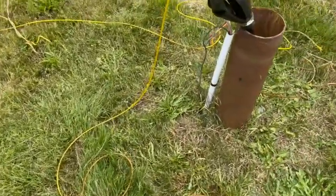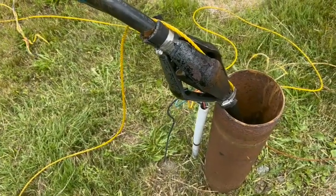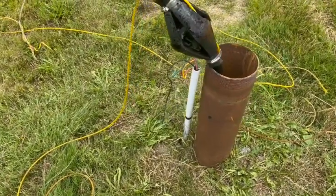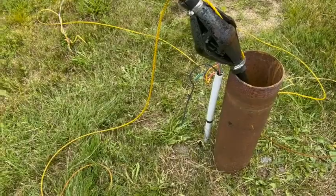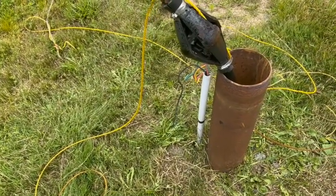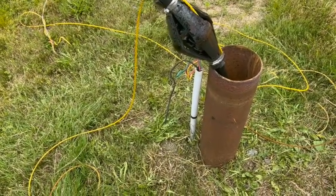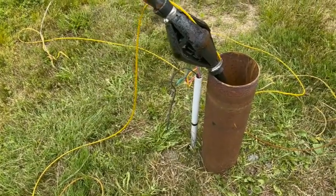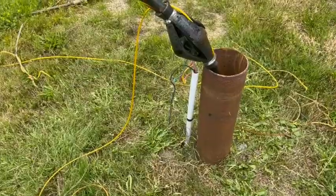Just hit one torque arrester. It's coming out okay. I can stop right here for, you know, a couple minutes, take a break, get a drink. So I'll get this thing all the way out, have it laid across the driveway here, and do our thing, change the pump, change the line, and then we'll wind up putting it all back down in there.